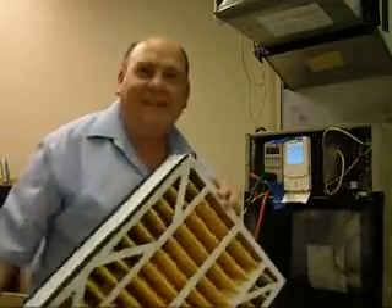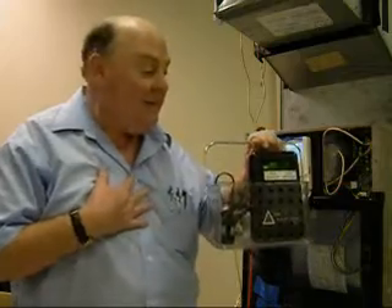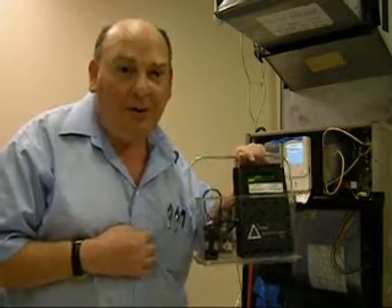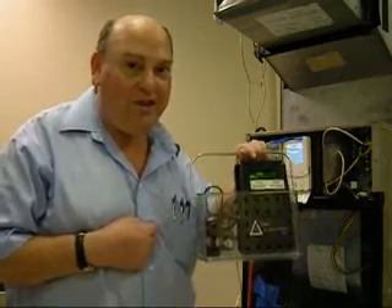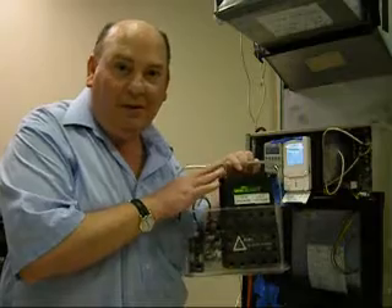There's no way you can look at this filter and tell me when to change it out. But I'll be able to tell you based on air flow and delta P pressure drop across the filter, and the most important thing is the particle count that's in the air — indoor air quality. You'll be paying me to clean the air and help you determine when to change out your air filters. I'm going to prove to you that you should change them out more than at a 0.4 delta P, or the three-month contract, or the once-a-month change. You'll change it out when either the air quality is worse in the room, school, or building, or when it's going to cost you too much money to operate the unit.